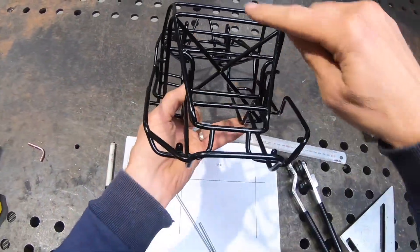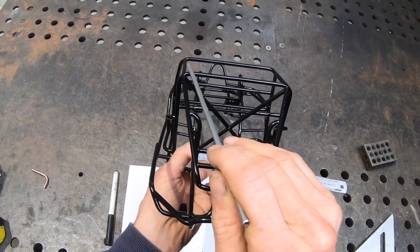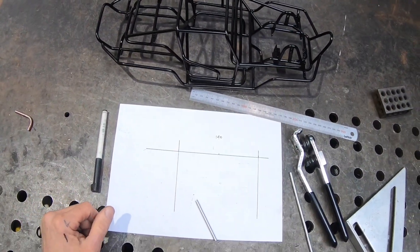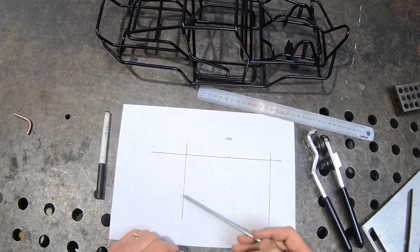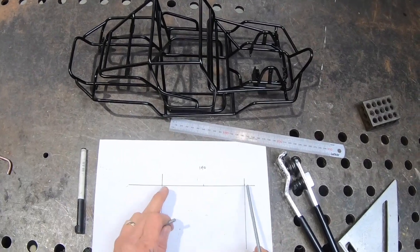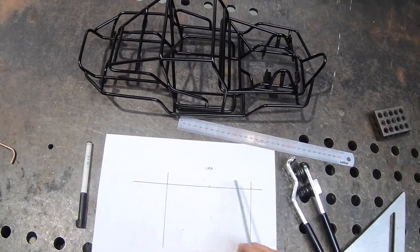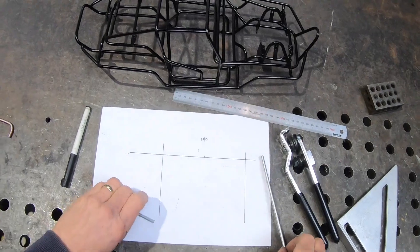What we're going to do today is I'll show you how to do a closed hoop — basically you bend up and around with the hoop and then back down. That's a common thing you'll need to fabricate if you're doing a custom cage. In this particular example, we're going to go 140 millimetres overall width for the hoop. I'm talking metric here, sorry for you imperial folk — 140mm overall width is what we want to achieve.